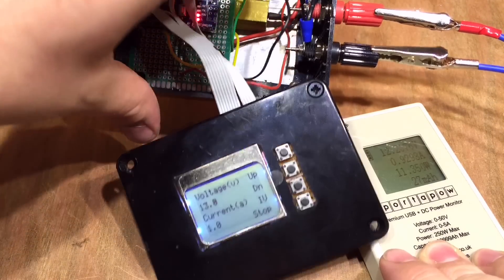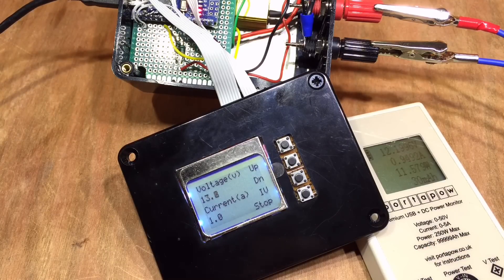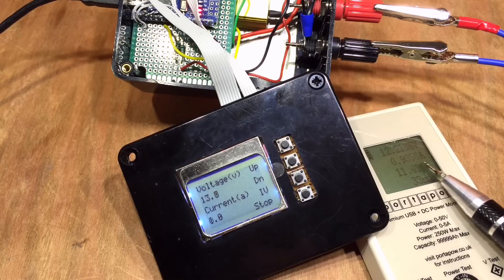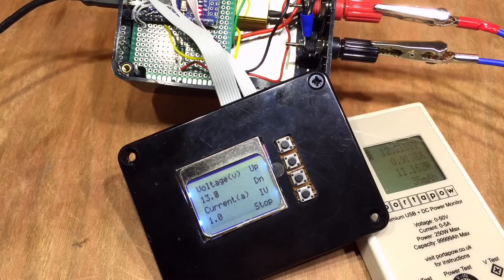It's not perfect. How hot are things getting? That MOSFET doesn't seem very warm, and neither does the shunt resistor. I'm really pleased. There's a range of about 50 to 60 milliamps of variation here, which isn't ideal, but it's better than I thought I'd ever get to be honest.